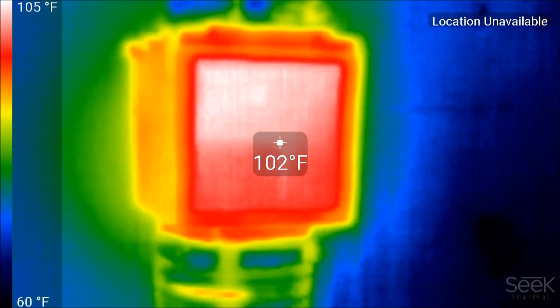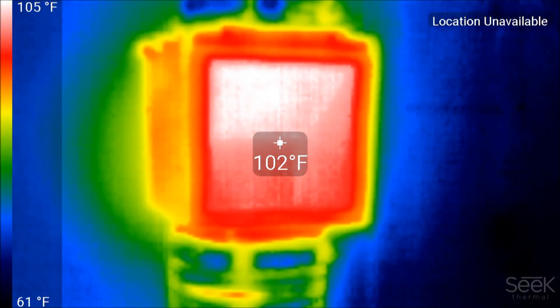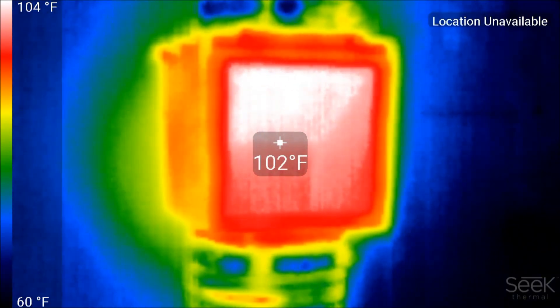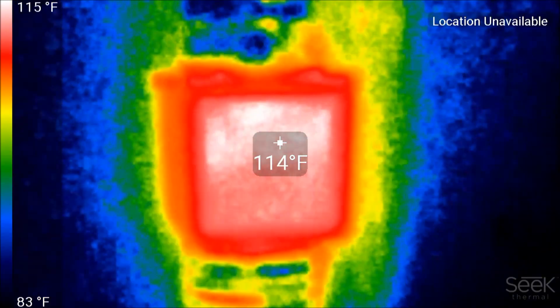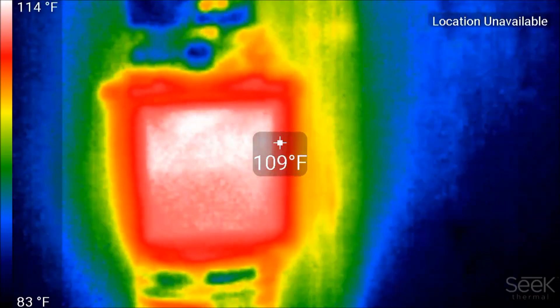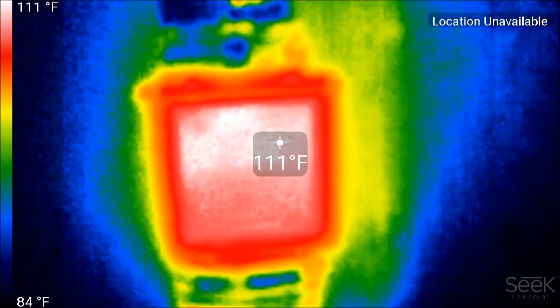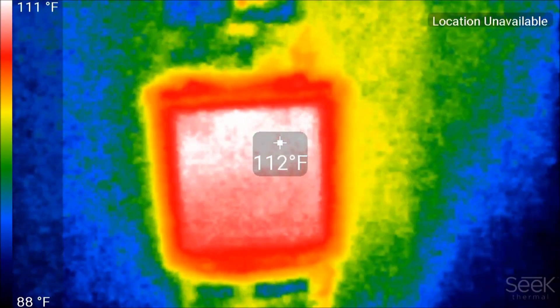I also have that room exhausted to another room so I can distribute the humidity — I don't want too much humidity in that one room. Too much humidity isn't good. If you have a really small space and can't get rid of the humidity, this probably isn't a good idea. But for winter use, if you've got a big downstairs basement, it's perfect — it adds humidity to the house and keeps static electricity down so you don't shock things when walking across the room.